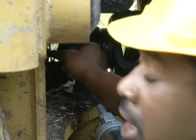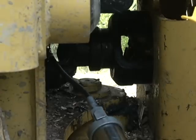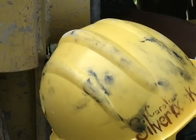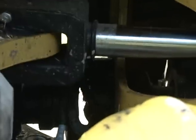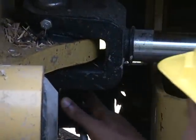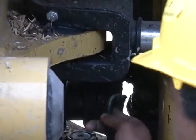Right here we have grease fittings, and this one is a T-fitting. Depending on where the machine is when you turn it off, the fitting might be on the other side. But it's a T-fitting so you can hit it from either this side or the other side. You just want to put it up there and make sure it snaps. I usually put about ten pumps in here — actually it only took three that time. You see how the grease started to come out? If you look in here, it's coming out through there.